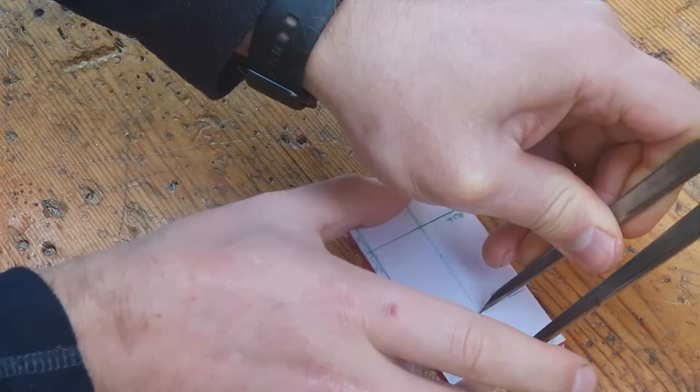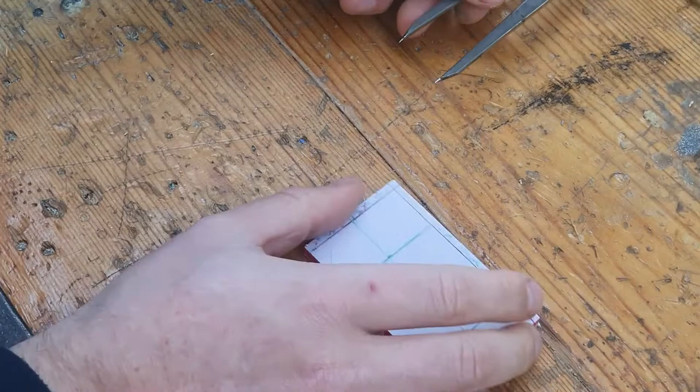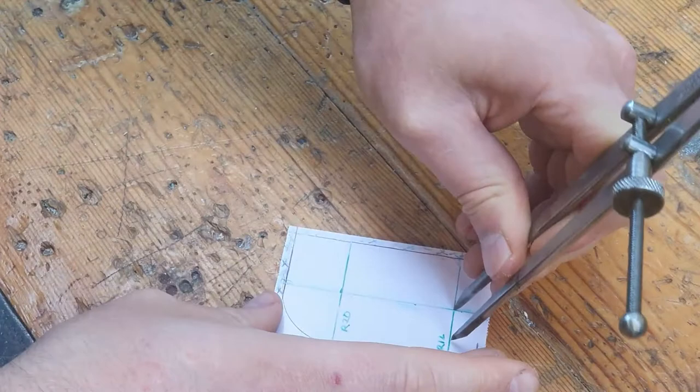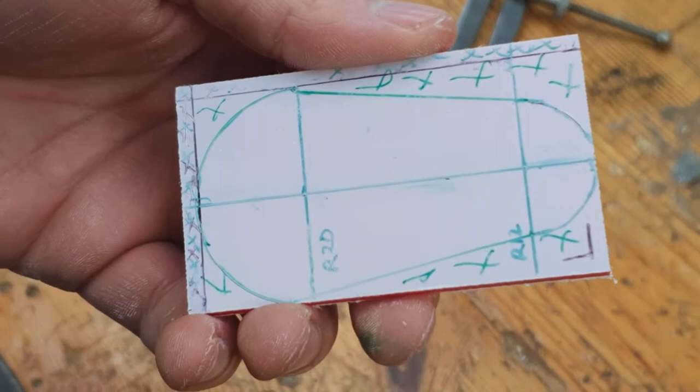I'm putting a lot of pressure on my left hand. The little trick I like to use is turn the work piece, not your spring dividers. So there we go, just about in at the end there. Same again for the smaller one — push it down the centre, use the knob to adjust it to the required radius, and scribe our arc.